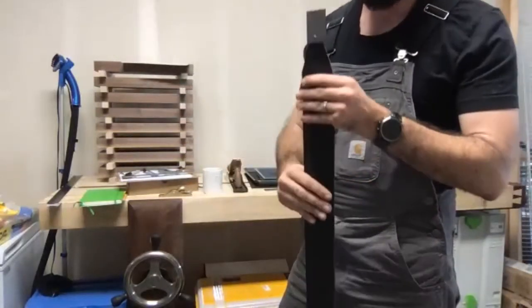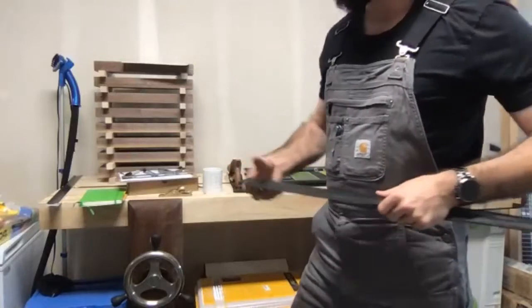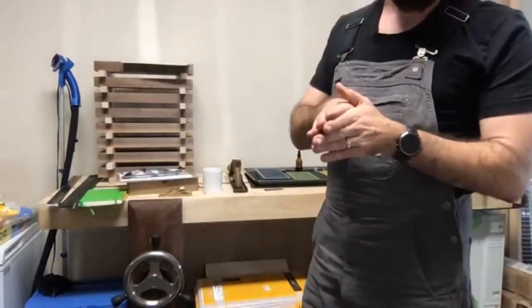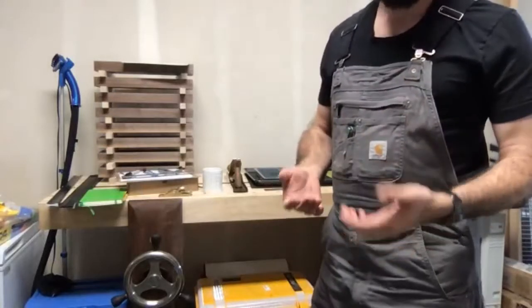You are going to be tempted to just sharpen the side that has a bevel on it. That will leave you in a situation where you are only dealing with one flat surface, but you're depending on the intersection of two flat surfaces. And so you'll never end up with something that's truly sharp, and it'll dull faster.